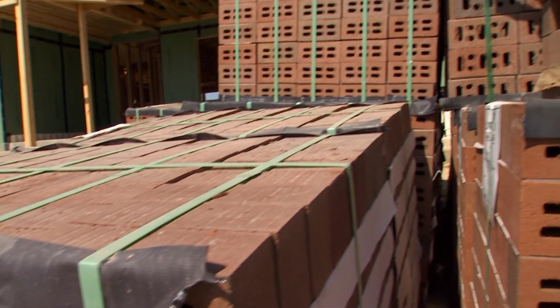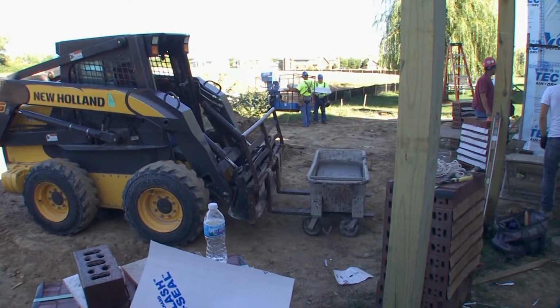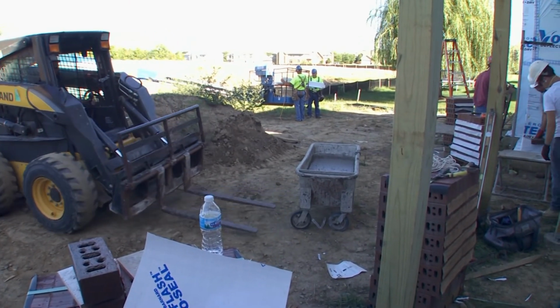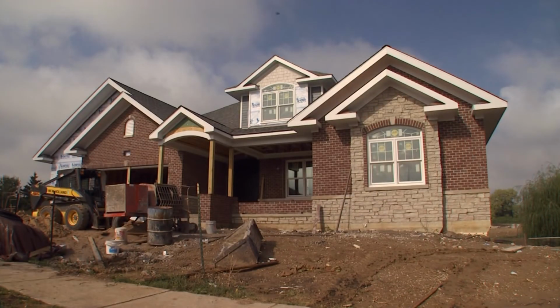Regardless of the different systems, the enclosures, whether it's brick, siding, glass curtain wall, you take a different approach to each one, but the elements are the same to keep out. Yeah, you're still keeping out, you're controlling air, you're controlling your thermal movements through the wall, you're controlling vapor if you need to, and you're controlling bulk water. You've got to keep the water out, because it's our enemy, but we can't live without it, right? It's one of those things.